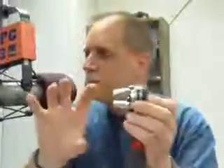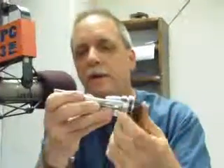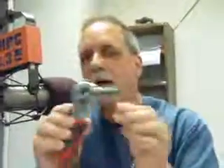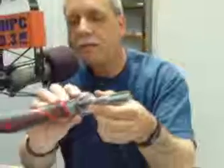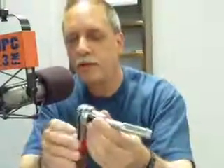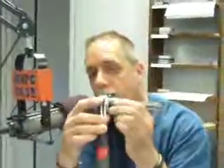This is used to put hooks into things, odd-shaped things. But look what happens when you take even a three-quarter-inch tap — you can put it in those jaws. And you can ratchet this: put it in one direction and tighten the tap into the threads, then flip the switch and loosen the tap out of the threads.